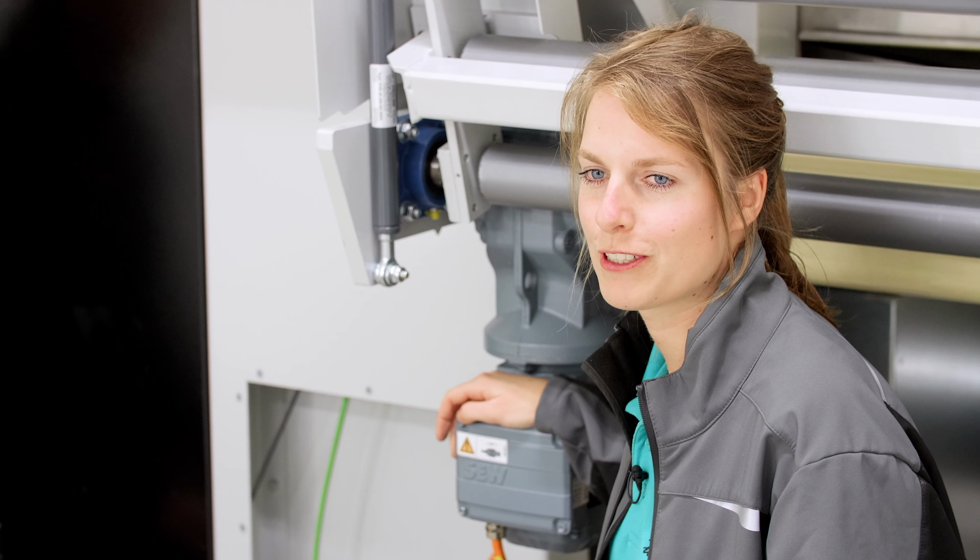We simply pull the air supply to the paint supply pump stand from the top of the 3/4-inch supply line using a T-fitting, put a half-inch connection hose on it and connect it to the pump stand. You don't need to do more, it will run. So now we will pull in the paper and then see the machine running for the first time.